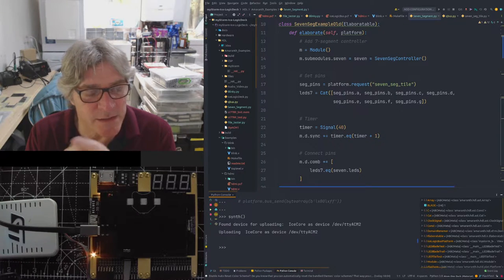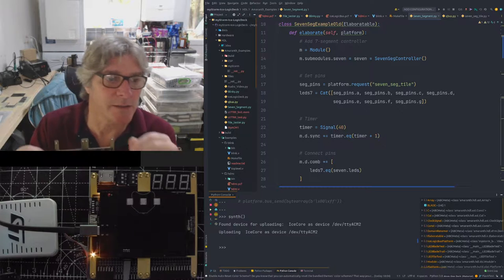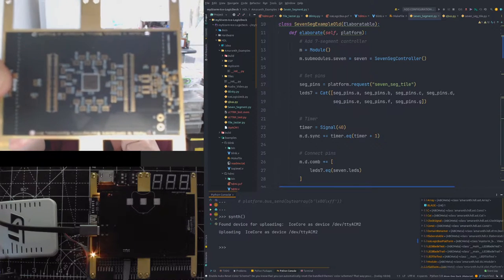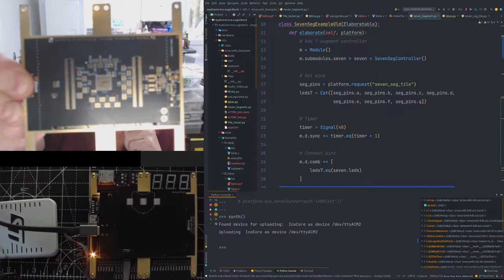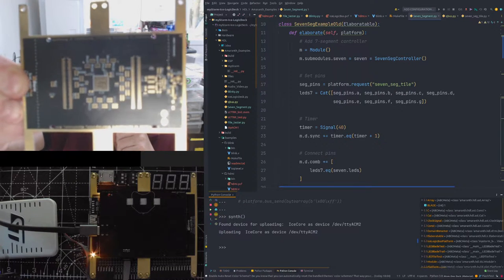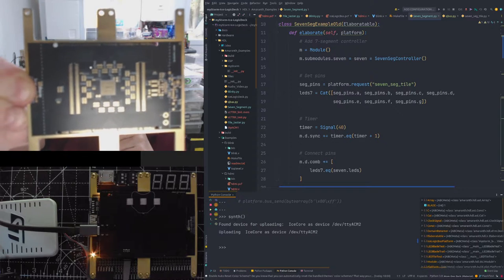Yeah, because there's three stages to the IceLogicBus build. Let me remind you again, guys, of what it looks like. That's the PCB. So all that stuff on the front I do via the normal reflow process, stencil, and then I place the components. And they're actually not too difficult to place. There's a couple of tricky ones, but most of it works nicely.